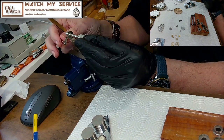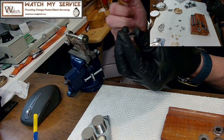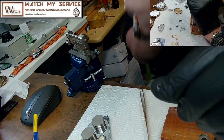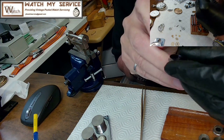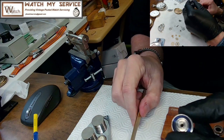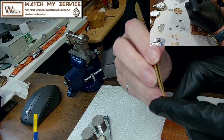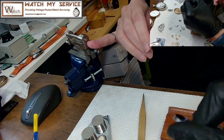I wind the winder backwards to unhook it, then check if the T-end is seated in the barrel hole. Unfortunately it moved — it's over in the wrong spot, which means I have to take the spring out and do it again. If the T-end tab isn't stuck in the barrel slot, you're in trouble. So I wind it in again and go for a second attempt.